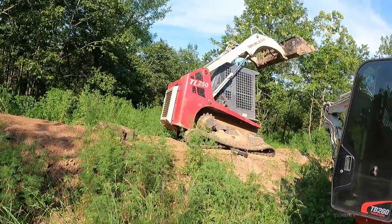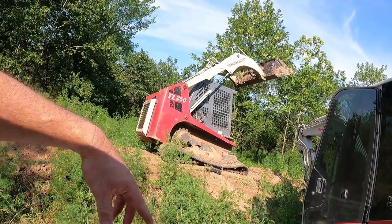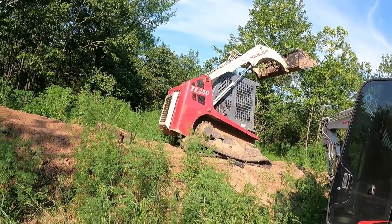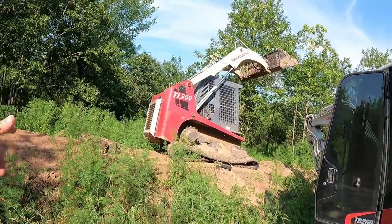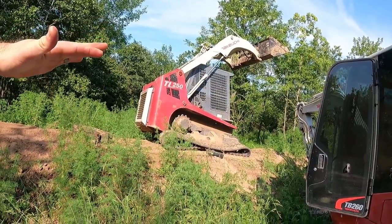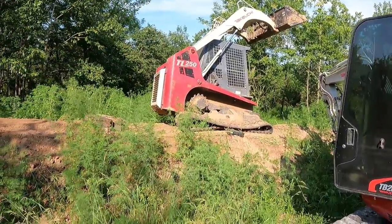Slide those railroad ties under the back of it and then use the bucket. I'll push down and that'll essentially raise the whole machine up. I just kind of got to watch it since I'm on the side of a hill, but it'll put pressure on the back one. It'll pick the back end of the back idler up, and I can put the bucket down and pick the front up more.